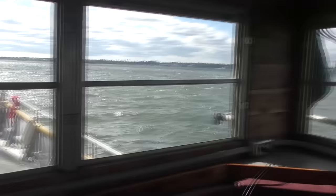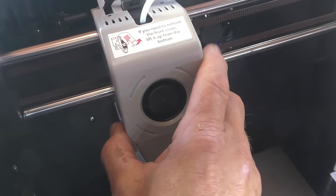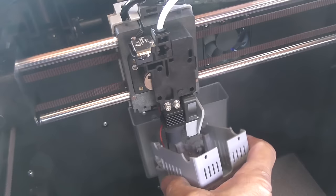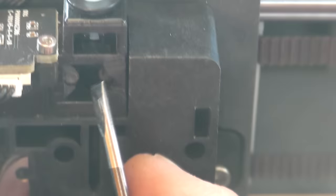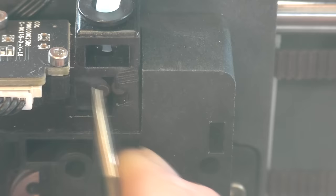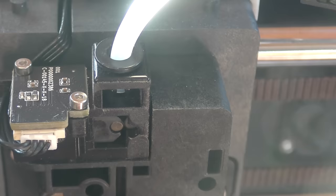Most things on a boat have to be stouter than on land because it gets rough even in the bay. I'm going to shoot an email off to support about that filament sensor and see what kind of help we get. A quick YouTube search says the extruder has the sensor right on the top of it. I can tell that is not the way it's supposed to look - this little roller is supposed to be over further. It snapped over just then - that's an easy fix. Six hours later they replied saying to check that the sensor is moving freely.